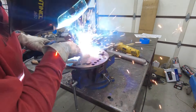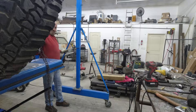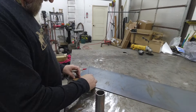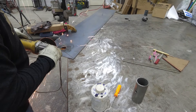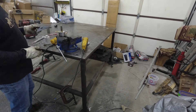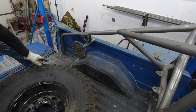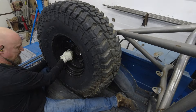For the spare tire carrier, we welded some steel studs to a mounting plate we got from Midnight 4x4 here in Salt Lake. We then mounted it to one of the tires so that we could put it in place and use it to mock up the correct location for our mount. We created a cardboard template, then transferred that to some 14-gauge steel plate. Once the pieces were cut, we used our dimple dies to add some rigidity and a bit of cool factor. The mounting plate is welded to a piece of inch and a half tube, slightly offset. This allows you to rotate the tire mount up and down so you can adjust for different tire sizes and keep the tire resting on the floor, making it easier to get the tire mounted.